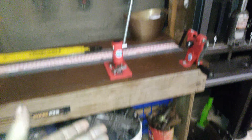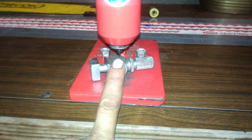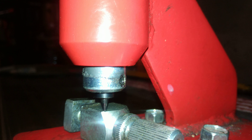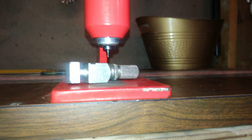This spinner and breaker — you don't need the expensive stuff. There's nothing wrong with this. I've never had any issues with it. Everything is original and I've spun hundreds of feet of chain on here. I'm always breaking and spinning chain because you never know what you're going to do with a harvester. Even tonight I had to break a chain a few times — I got parts chain down there. I had to take a couple of drive lengths out and put a chain back together because I bent some drives and had some issues today on a double. These get used daily.